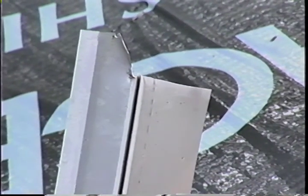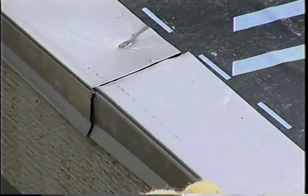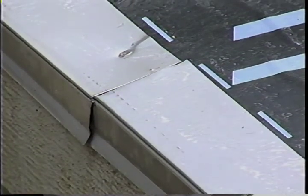Okay, first, Steve, you want to cut the back of the starter strip out, leave in the face. You slide it in behind the existing piece for your tab.